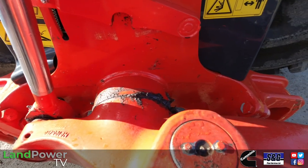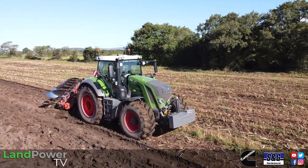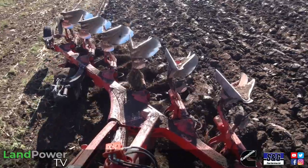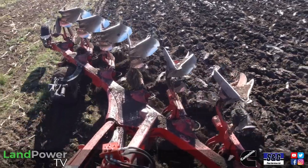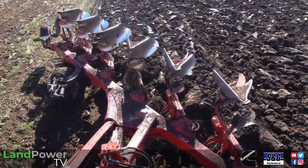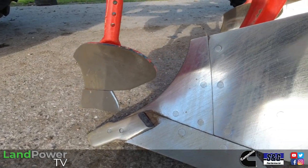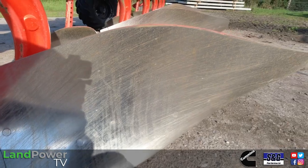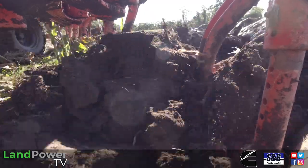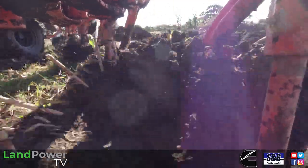She is for the bigger tractor with bigger output. With the hydraulic variable width, we can do up to 22 inch furrows, so we can really cover some width and get some output out of the machine. With those big furrows, you can get some big tyres dropped in there as well if need be. We've got the LPO body on the plough here today - we offer a wide range of bodies, from slats to shallow bodies depending on the area of the country and what the customer wants. We can work with a 710 tyre quite comfortably in the furrow bottom.